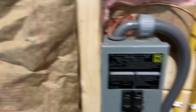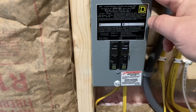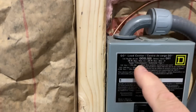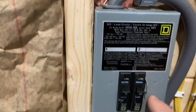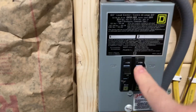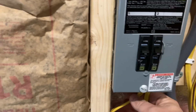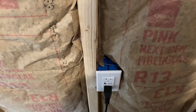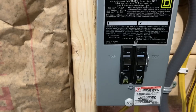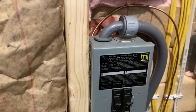As an option for off-grid setup: my conduit comes up and goes into a sub-panel box — a Square D, model number Q02L30S — so it has two slots. I currently have them both off. Since there are two slots, I have the 15-amp which feeds a plug that charges the solar generator, and then the 20-amp plug runs out and feeds a couple plugs in the cabin.